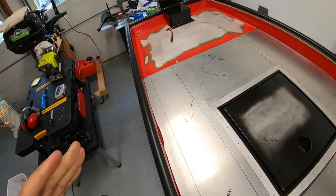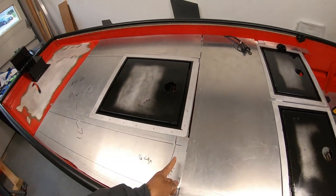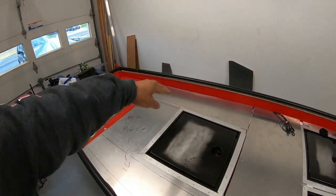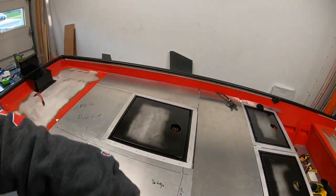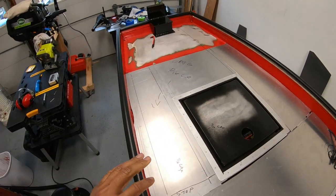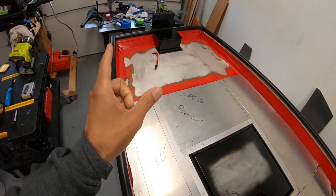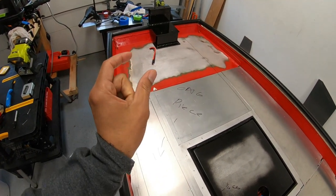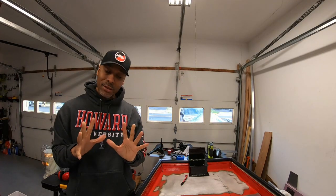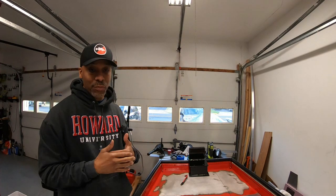I'm going to take my time and do this right — don't want to cut the hydroturf incorrectly. The first piece will go from the bow of the boat to the edge of this hatch right here, and I've drawn some lines out just to keep me honest on where my cuts will be. The turf is not wide enough to cover from one side of the boat to the other completely, so I have to do it in two pieces. I'm going to cut conservative — meaning I'm not going to cut on the line, I'm going to cut over some, leaving me a little bit of extra turf, and I'll trim that out as I'm working around the boat. I'm a little nervous on this — want to make sure I get it right. I don't have a lot of turf to play with; mistakes could be disastrous.